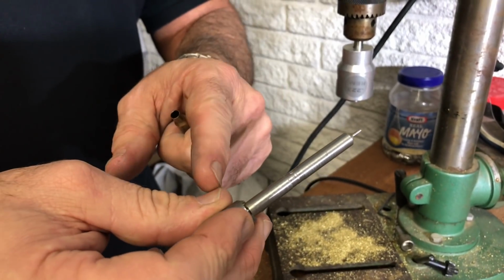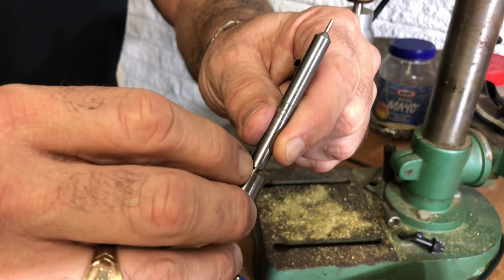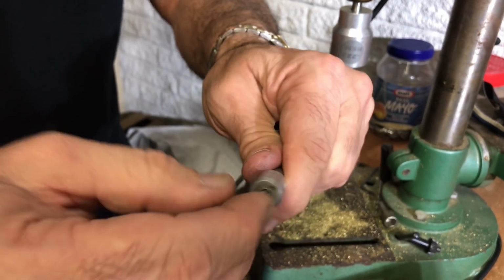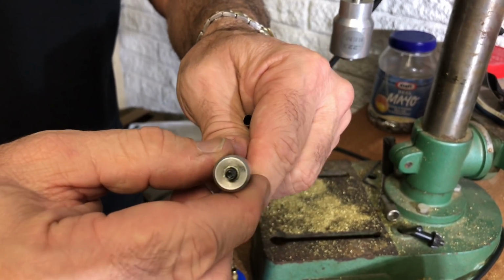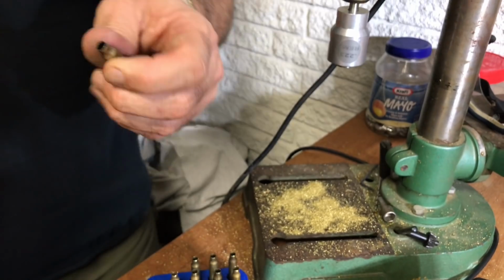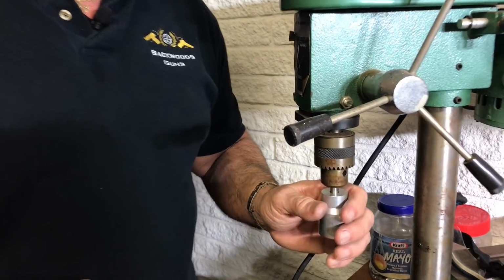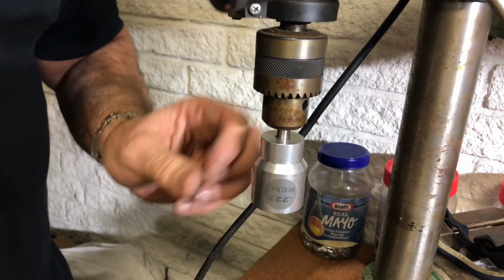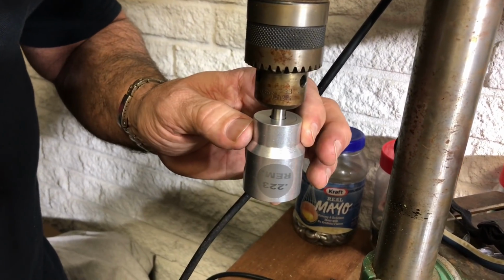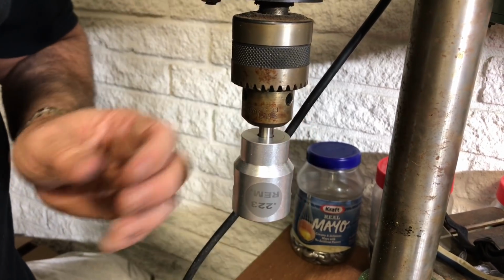Okay guys, most of my calibers, I use one of these Lee trim gauges, put it in my trimming stone cutting head, and I screw this into my Lyman case prep machine, and I trim like that. But where I shoot so much 223, I bought one of these World's Finest trimmer heads. Okay, and I set the trim length to 1.751, 1.752 right in there.